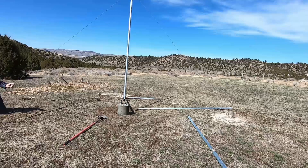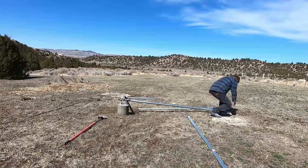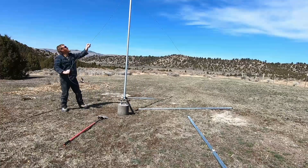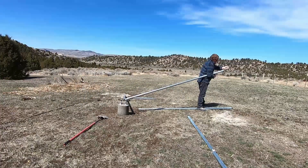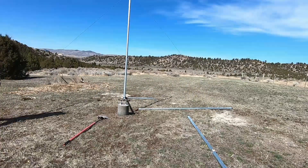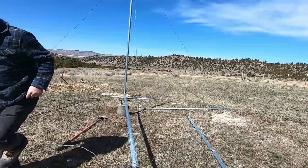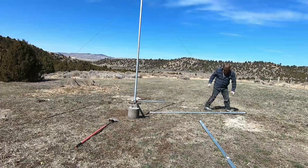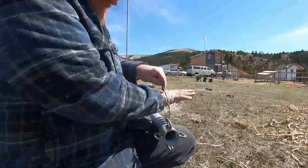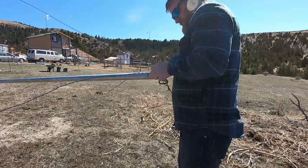We just kept it short — we're gonna see how this does. Anytime you put in a wind generator, unless you're in an extremely windy area, the exact location is kind of a gamble. There are formulas where the wind generator has to be 30 feet above the nearest object within a certain distance from it. I don't know those stats off the top of my head, but the purpose is to get clean air.